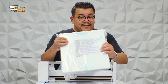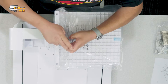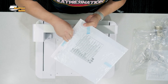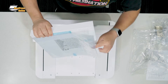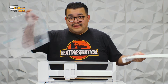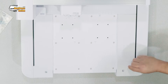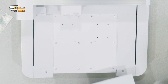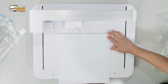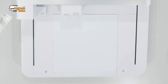Now we're going to install our electrostatic bed. This is the electrostatic bed that comes with the machine. We're going to go ahead and unpackage this right now. It is a little bit delicate, especially the surface. As a result, it's going to come with a protective cover — this clear plastic that you see attached to it. Please do not think this is just protective plastic that can be discarded. Don't lose that. These tabs should be in the open, outside position — but just in case, double check. Then we're going to place our bed at the front and slide it on in. Make sure it's nice and snug, and then secure it in place with our tabs.